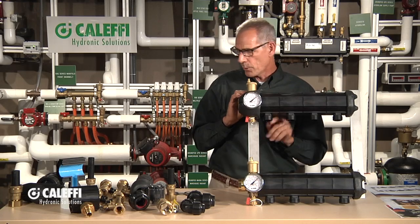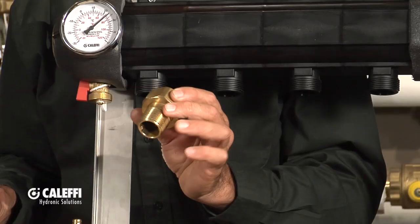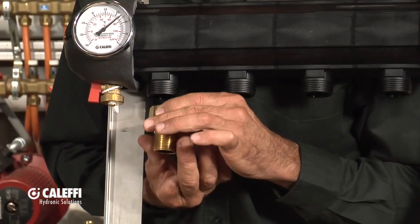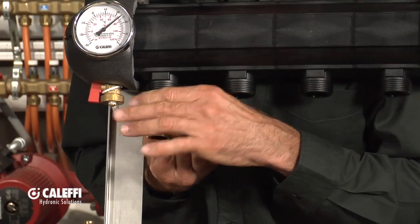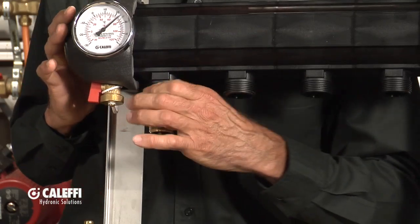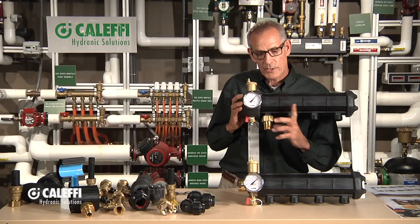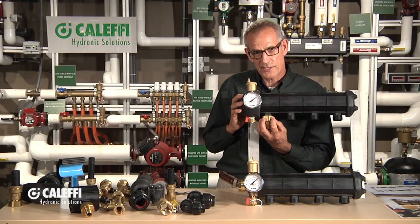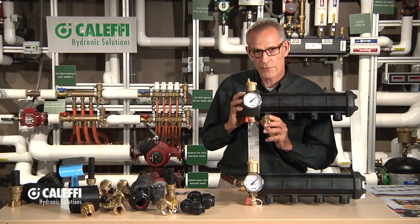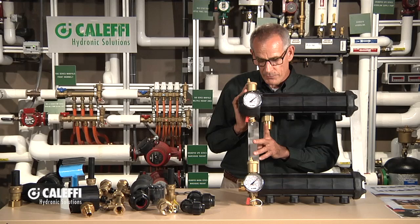Now let me show you the different fittings that go on the ports. The most basic fitting is a one-inch male thread by union nut connection. There's a flat gasket that goes in it. You tighten this up until the nut bottoms out against the end of it — once you're out of thread, it's tightened and it's not going to leak. We engineered it to bottom out and tighten at the same time, so you won't tend to put a big wrench on it and distort the threads. As it bottoms out, you've got a leak-proof seal.